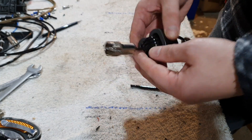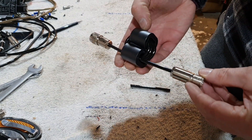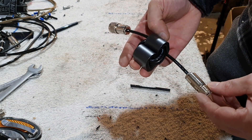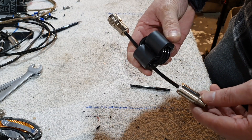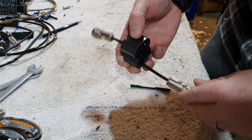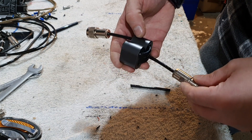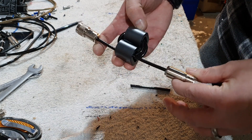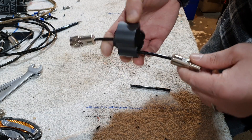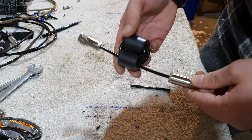Now you don't need to see me putting on the plugs, you can see that on any video. But there we are — that's our HF choke, so that will be effective 20 meters through 10 meters. You can't buy these, but I would urge you to go out and make these. I'll put a link below to GM3SEK's website where you can find all the information on how to build these. So I built this for the Moxon, but obviously it's going to work with any application. One step forward — okay guys, thanks for watching, 73, we'll see you in the next video.